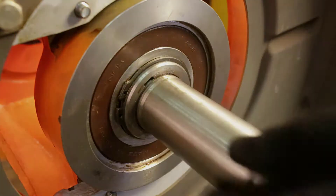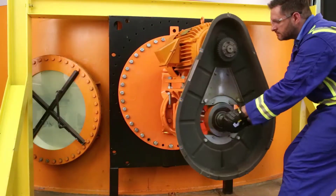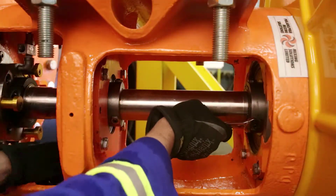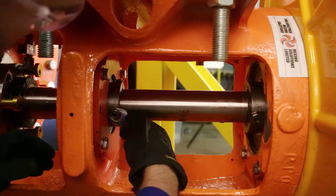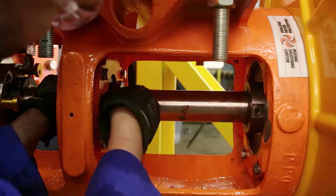Remove the key and then remove the snap ring off the back of the mixer. Next, we're going to lock out the mixer shaft. It moves forward into a metal-to-metal tapered shutoff. Loosen the set screws and lock nuts. Note that there are three set screws on the inboard bearing assembly and three set screws on the outboard bearing assembly.